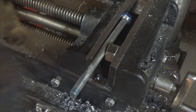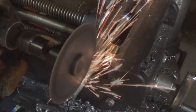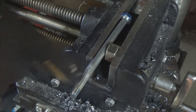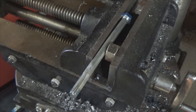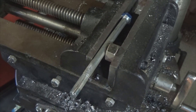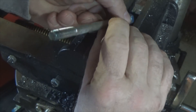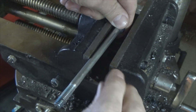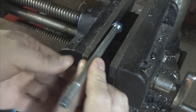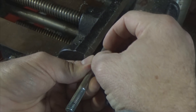What I'm going to do is just cut a slot right down through there, just like the tool you've seen before on my past video. You can see I've got that slot cut through there — it does not have to be deep. Now I've got one slot, so I'll turn the bolt over about 90 degrees. It's hot, so I'm pressing the bolt against a nut to hold it in place.